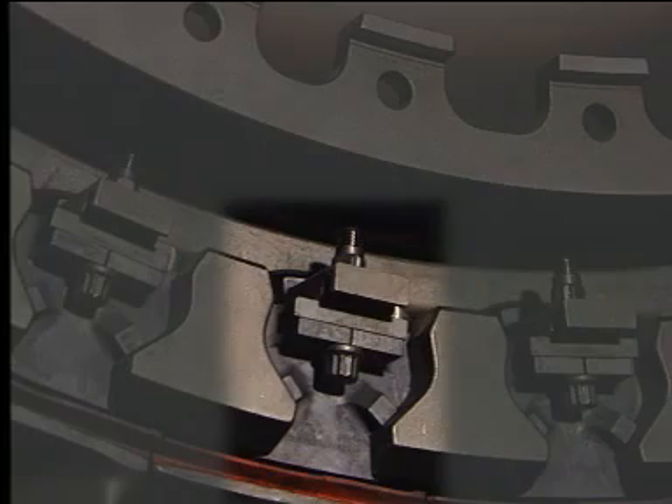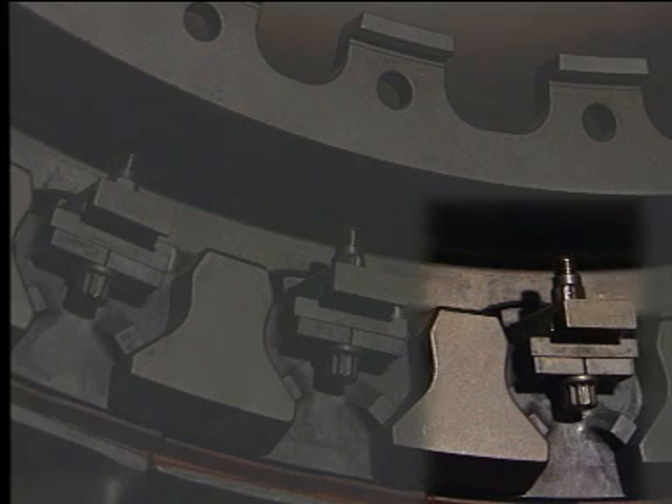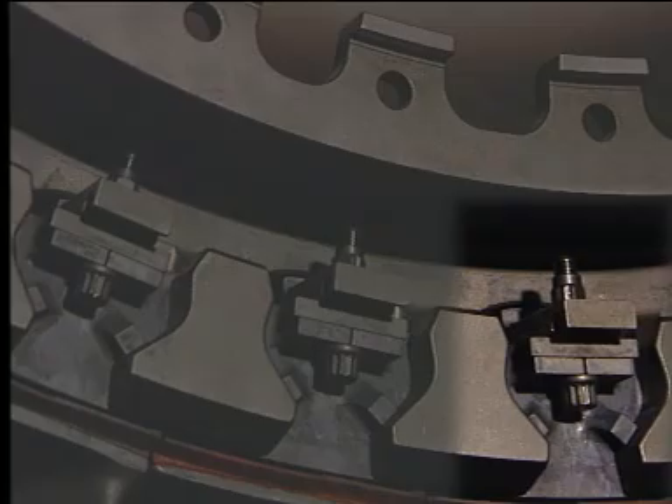Note: when you remove only one fan blade, it is necessary to remove the blade retainer, spacer and key from the adjacent blade. The removal of blade retainer, spacer and key will permit enough blade movement to disengage the mid-span shroud.